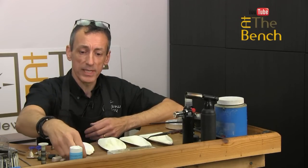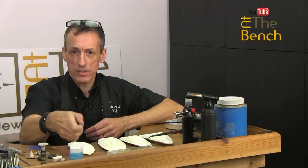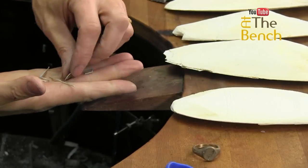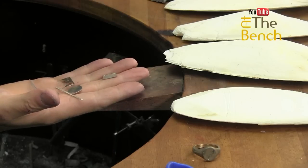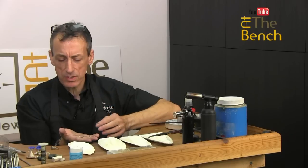What you don't want is to have anything with solder on the silver. It has to be clean — free of any solder. Because the solder may lower the quality of the silver; it may also impart different properties because you're melting a solder alloy in with the silver alloy, and you may not get a nice cast. So preferably you want off cuts — pieces that I've sawn out of a bezel, little bits I've drilled, stamped, and so forth.